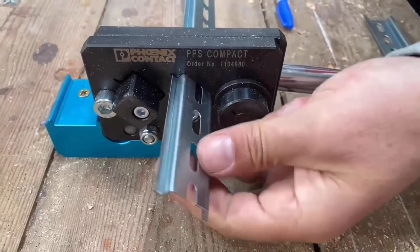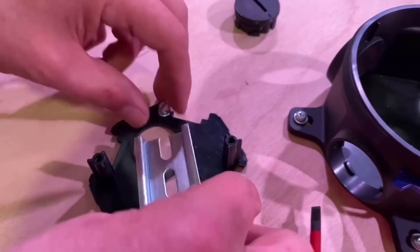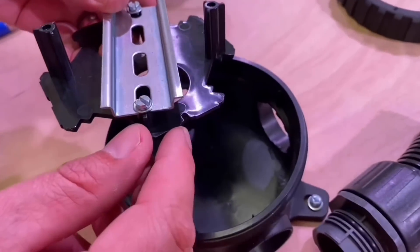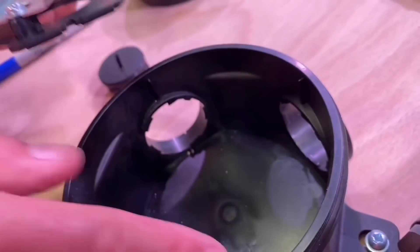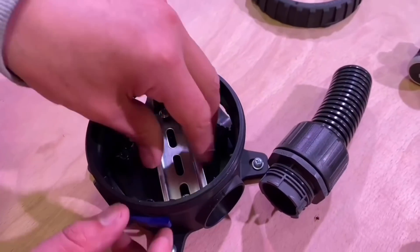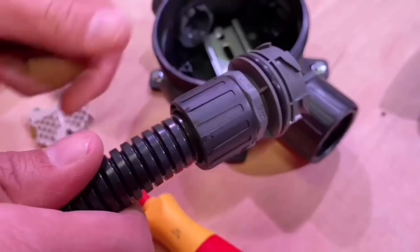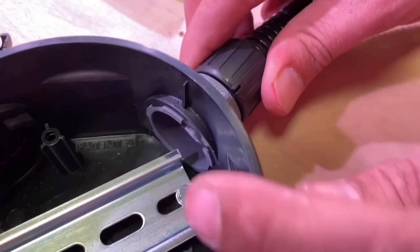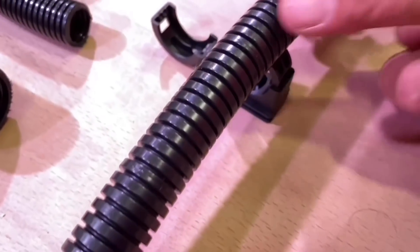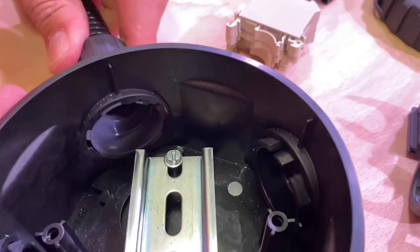We're going to assemble a DIN rail into the box. Cut a short length of DIN rail and fix it to an accessory plate. You can have it raised off if you want to pass wires underneath, or closer to the back of the box — both positions are on the same plate. The plate just aligns with tabs inside the box and is held in place when we bring in the glands. It's important to put it in before the glands. Then just slot the Flexicon conduit into the adapter — no tool required, just push them into place. Push it in and it locks. We do one on each side — exactly the same process, no tool, just lock into place.